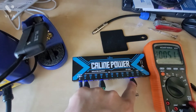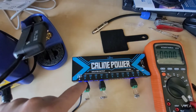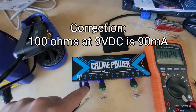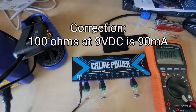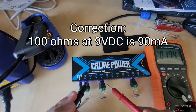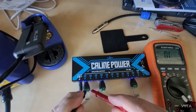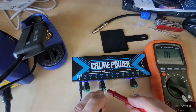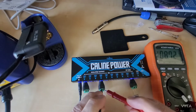So that's about 450 milliamps of load, about 250–260 milliamps, and then exactly 90 milliamps for the load. We want to look for 9.01 volts on no load. Now, under load — we have 8.9 volts, that's good. And 8.7 volts under load — that's really good.